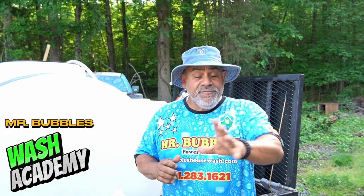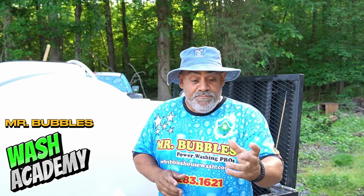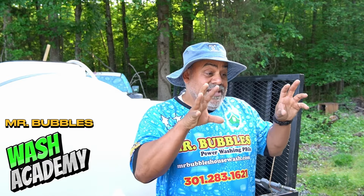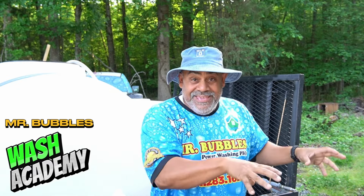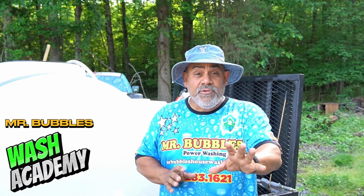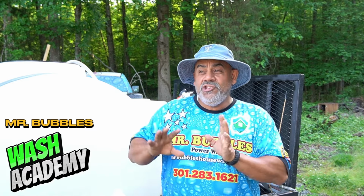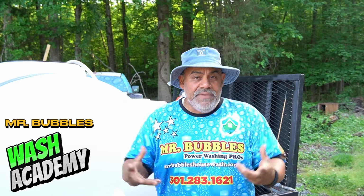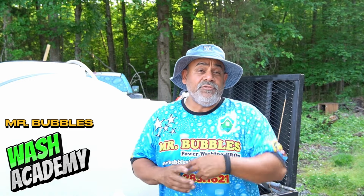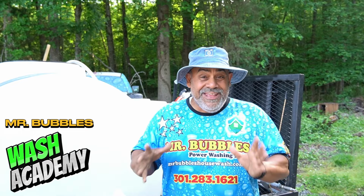Now, most of you guys, like 95% of you guys, are going to be batch mixing. When you batch mix, it just means that you are pre-making the house solution that you're going to need for that day. And what I recommend you guys as new guys is you're going to need about 10 gallons of mix per house. So if you have three houses to wash that day, I would recommend you make about 30 gallons of mix.